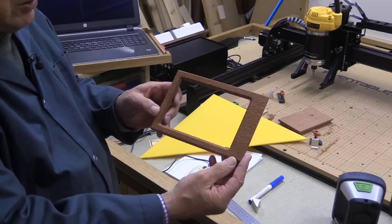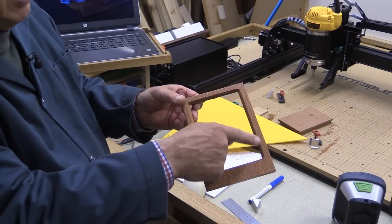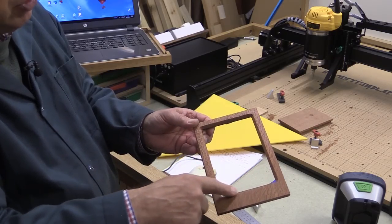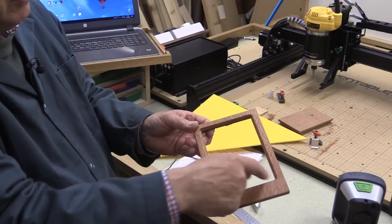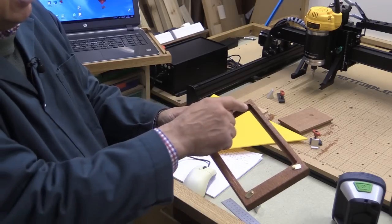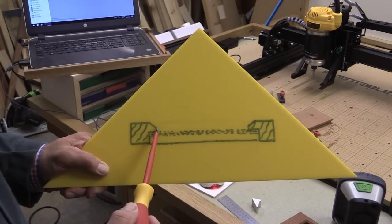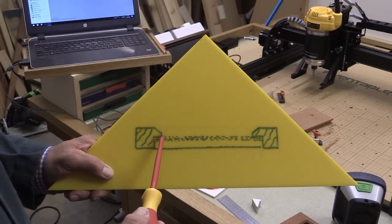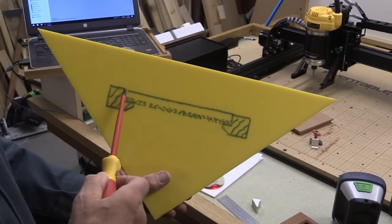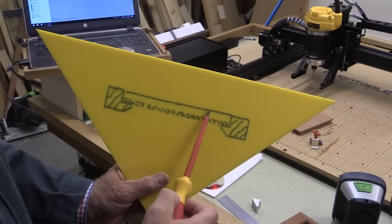This piece is very simple to make. It's a rectangle of wood that's had three separate toolpaths. The first was with a 90-degree V cutter which cut this part out here. The second was with a spiral upcut cutter, quarter inch, used on the inside of this chamfered piece. Then I turned the piece over and with the same spiral upcut cutter I relieved the back, producing a clean edge. We then did the rebate cut into here which provides the space for the glass, the picture, and then the backing piece.